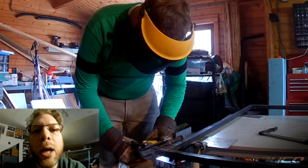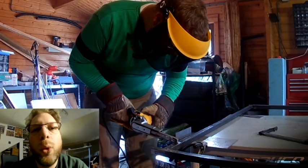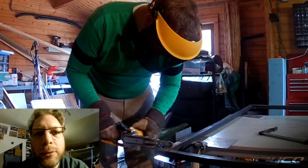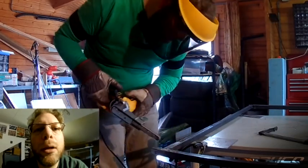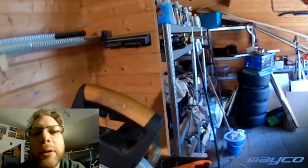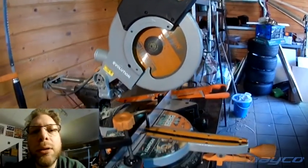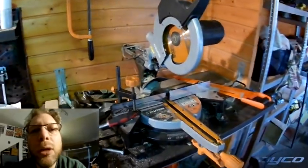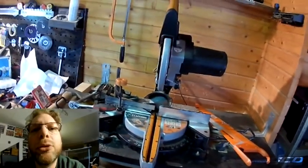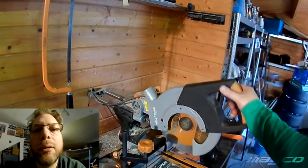Now a little bit about flux welding: if you want to start with it, what should you expect? Equipment-wise, I made a video about it. You need everything you need for regular wire welding: a contact spray to prevent the wire sticking to your torch, good gloves, some magnets, and of course a proper welding helmet so you can weld with two hands free instead of holding a mask with one hand.